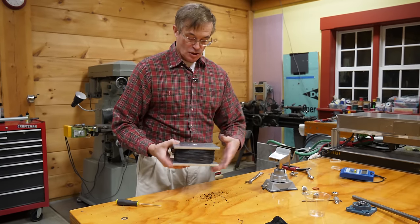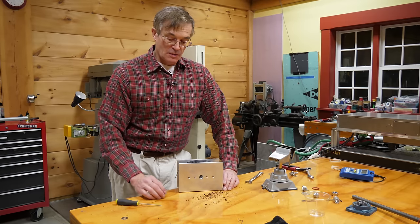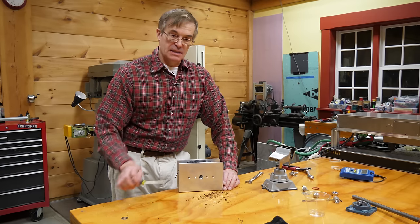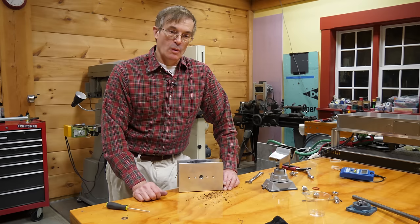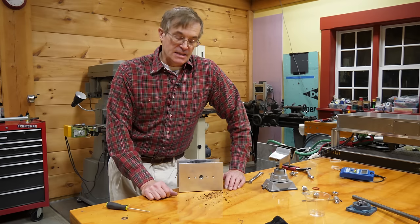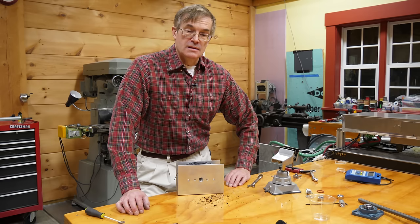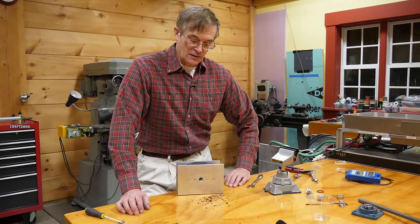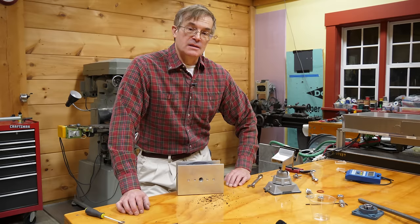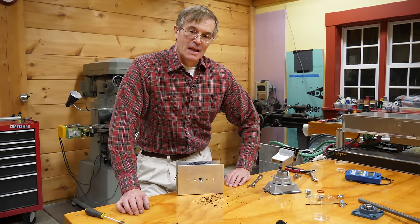So not a bad way to do this — a very convenient method of creating a yoke. You could use even more wire and eventually the field on the outside would completely disappear, and we'd probably get up to about 1 to 1.05 tesla. But this was safe, convenient, and easy, and I'm going to be doing this from now on. I hope this was useful and interesting. Thank you very much for watching — please subscribe because it always helps out the channel. Have a wonderful evening. Good night.